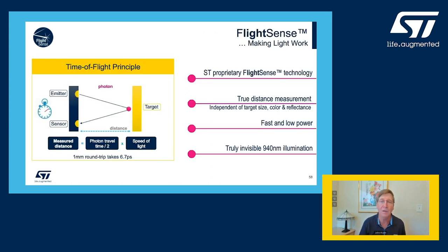For those who didn't know about time of flight: this graphic shows one photon going out of the emitter, hitting a target, and coming back. The emitter is a vertical cavity surface emitting laser — a VCSEL — and it shoots millions of photons out against a target. When the photons come flying back, they're captured by a SPAD, a single photon avalanche diode, which ST pretty much invented. That stops the stopwatch. Knowing that time, you take it divided by two and multiply by the speed of light to get the distance in millimeters. It's very accurate, and you can determine when a finger comes within a few millimeters or inches of the button.